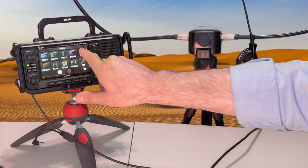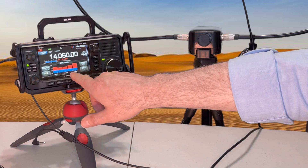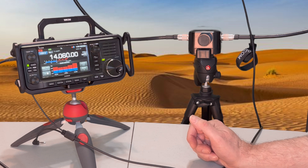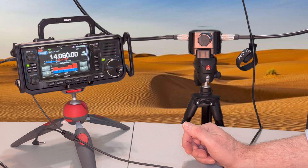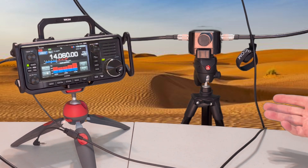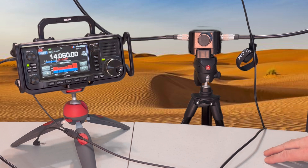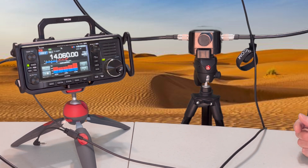Now let's take a look at the SWR. The sweet spot is actually right on my frequency — it's just barely 2.0:1, and that's not a real good SWR. However, another issue with mag loops is they're very much affected by things around them. This is not a good environment for it — we've got metal components, the radio is right next to it, and that all affects the tuning and the SWR.